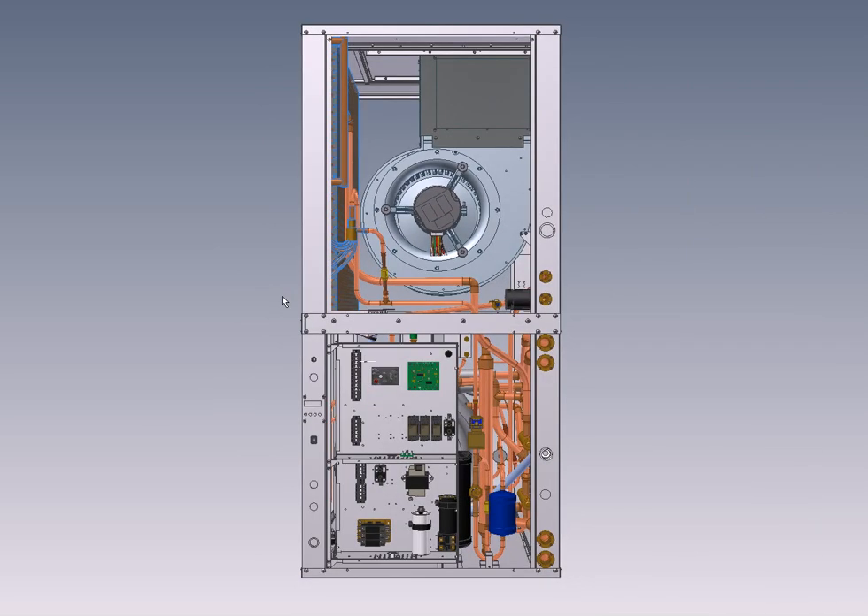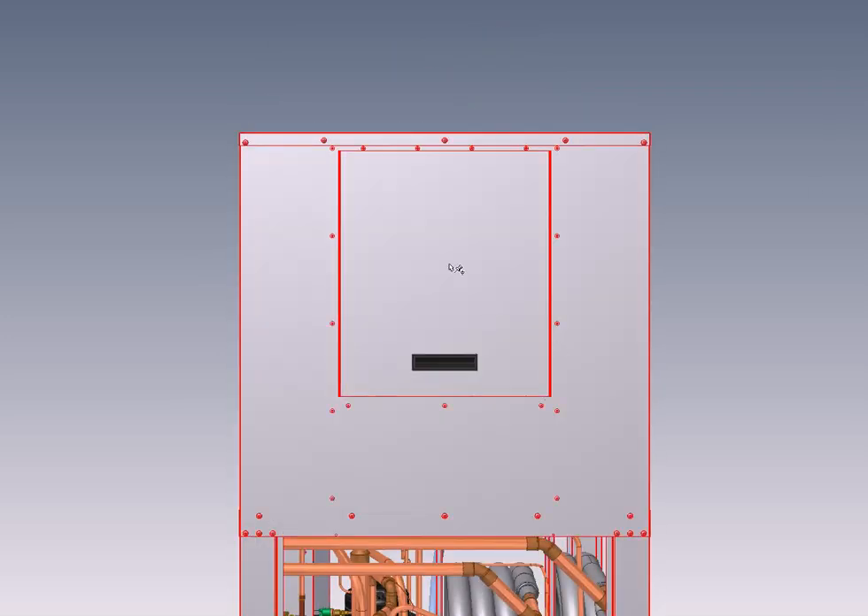The blower, you can see here, is of course a very important component. It moves air through the forced air system quietly and efficiently. The blower is full-sized as opposed to the tight blower found on most competing units, which means it spins slower for the same airflow, resulting in less air noise. The blower can be changed from top to side discharge in the field — another uncommon feature among geothermal heat pumps.